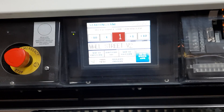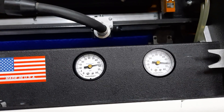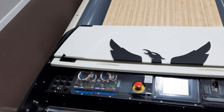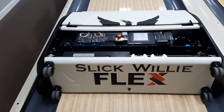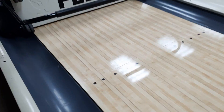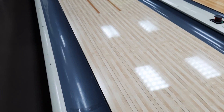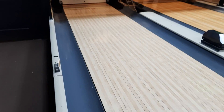We're going to apply a pattern called Wall Street Version 2. We're going to strip and re-oil the lane both ways. We'll hit the start button to get the pump going, and once it gets up to its proper pressure, we'll get the lane machine physically on the lane and allow it to go down. What it's going to do is strip and oil at the same time. The fresh oil is applied in a specific array — it's called a pattern — and that's going to allow us to bowl on a good pattern.